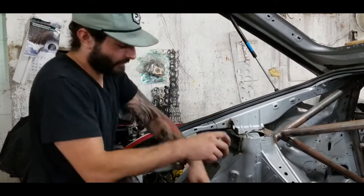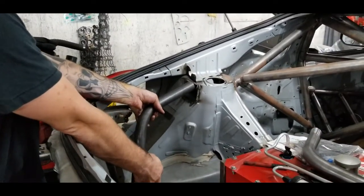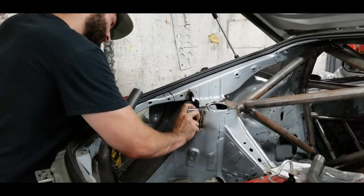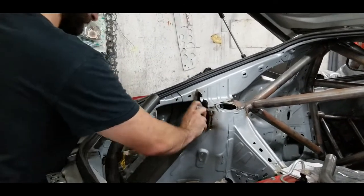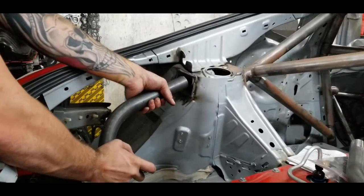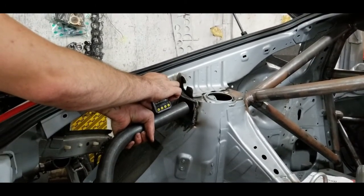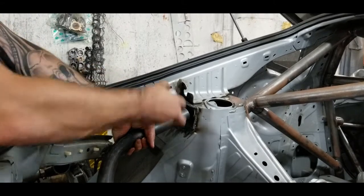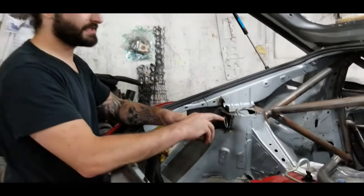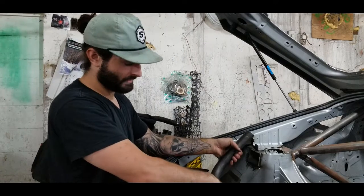Before, all we had to do was set the tube on the frame tie-in and measure the angle. This time we have to calibrate to match the angle of the mounting plate, set our piece up, make sure that our apex is marked, and then grab the angle that this sits at. 90 degrees minus this angle is going to be the angle of this bevel. And then all we have to do is line up our apex with the rotation on the bandsaw and get it all done.